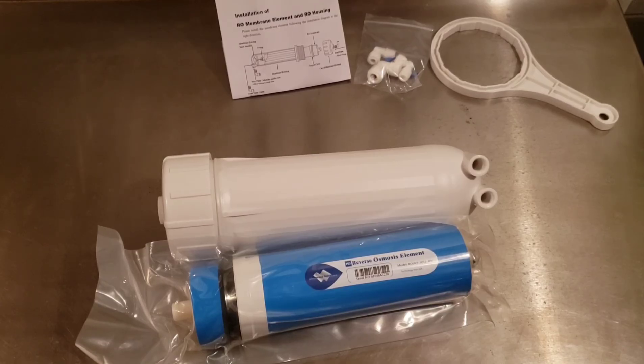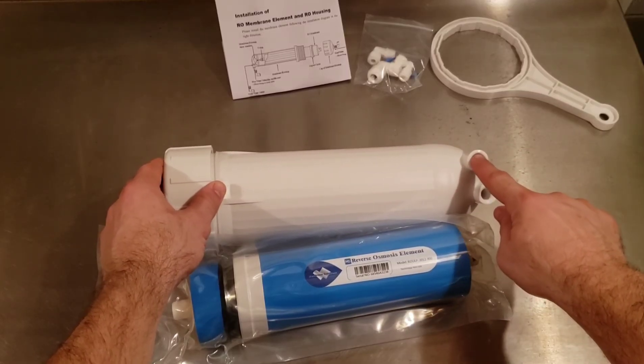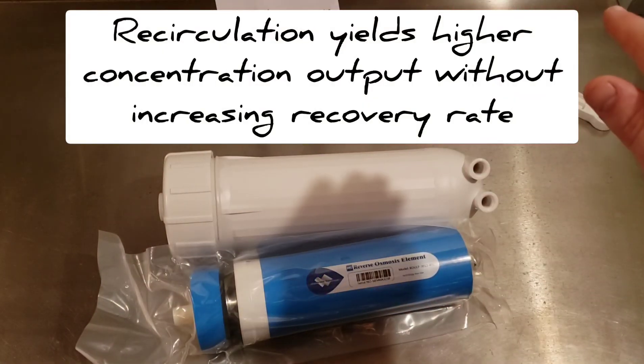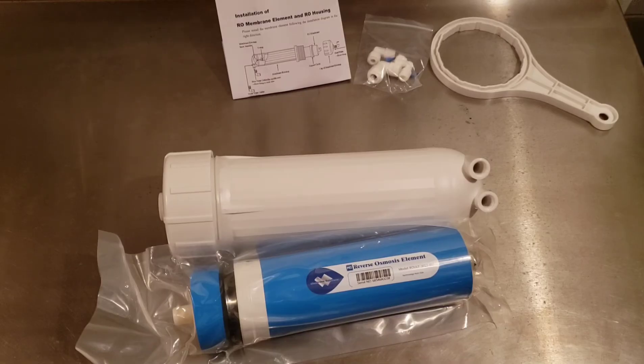One other concept to increase concentration is recirculation. Recirculation takes a portion of the concentrated sap and recirculates it back through your pump and membrane, mixing with additional input feed flow. This will asymptotically taper off to a specific sugar value. Recirculation is controlled by a second needle valve on the recirc loop where you throttle the amount being reconcentrated. Instead of just doubling from 2% to 4% sugar, you might be able to get up to 6% on a single pass with that recirculation loop.